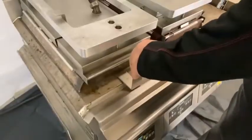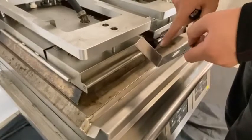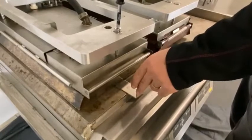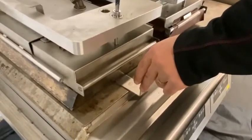When we start the gaping procedure, we're going to start with the L-shaped tool. We want the notch to stop as it goes into the platen, so we go into the middle and wind the adjuster counterclockwise to raise the platen.